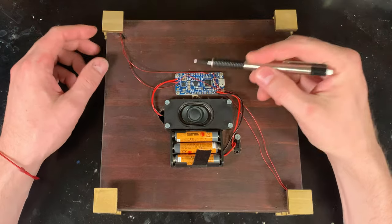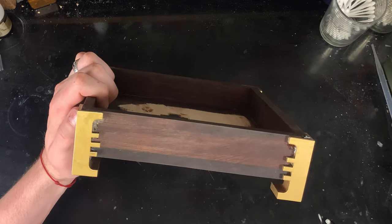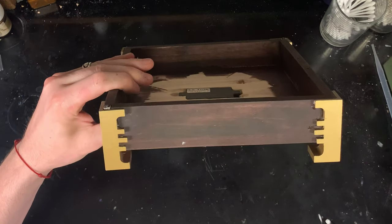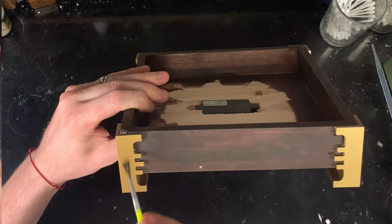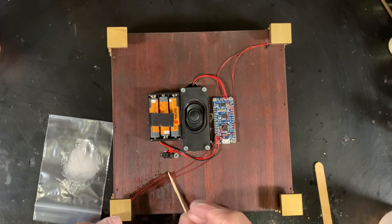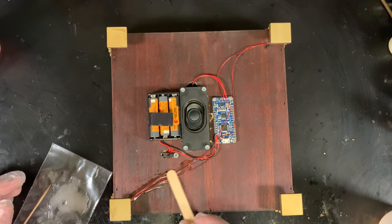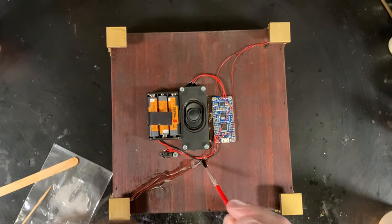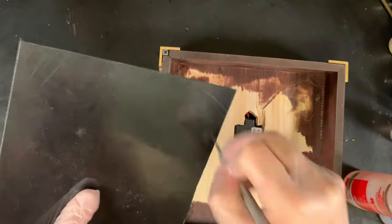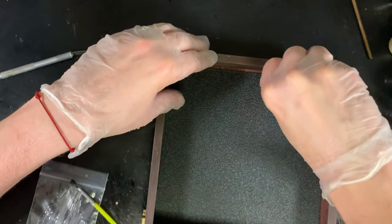Here it is all soldered up with audio trigger pins and power in. After being manhandled and banged around a bit I need to touch up these corners. Little known fact: if you need to do touch-ups you can spray paint into a paper cup and then use a brush to paint with it — that's what I'm doing here. Now in the final stages, I'm using two-part epoxy resin to coat all the wires and go over the circuit board so nothing can get knocked out of place. I'm also filling in over the switch screws — only got one screw in — and be careful not to get epoxy into the switch itself or it will stop working. I then flipped it over and used the remaining epoxy to secure the HDPE sheet.